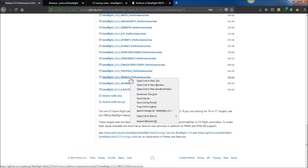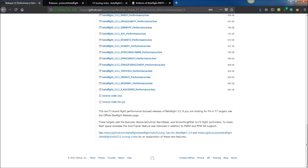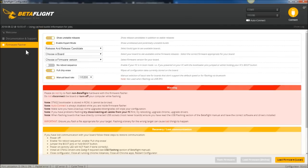To flash these targets, click on one of them and hit Save to your computer. After that, go into Betaflight, go to the Flash page, go to Load Local Firmware, find the target, and click it — it will load. I don't believe you need to pick your target in the target selector up top, but I always do it. I pick my target and then hit Flash.